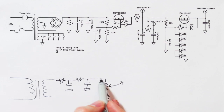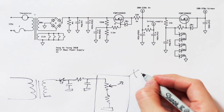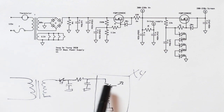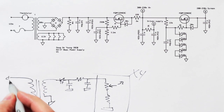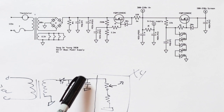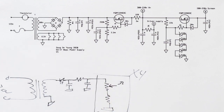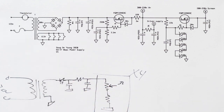And this is x4, right? We just multiply this times 4, so you have 4 of these little guys. They all have negative. Obviously this is grounded right here, and these guys right here get the 120N. And all these values, you just adjust them so that you end up with that negative 22 in the middle of your operating range, right?